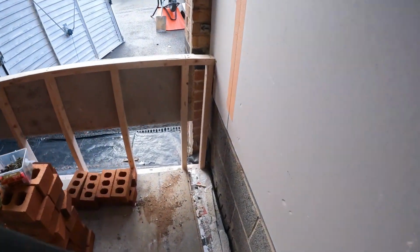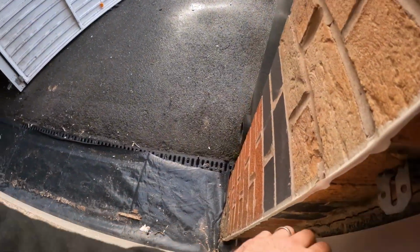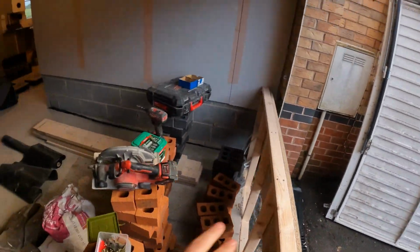Nice and easy. We can also come through the stud work. So the builder wants us to clip round and then pop it into this cavity and just clip on the back of that, and then through to these two sockets. Nice and easy. So Ellis is going to get on with that now, and then we're just going to mark up for 8 downlights.